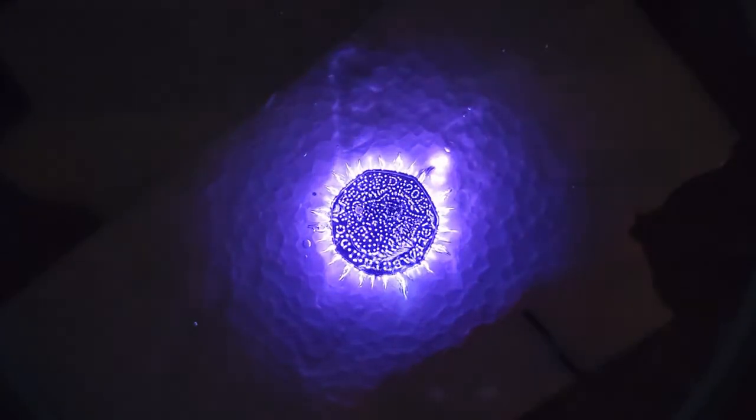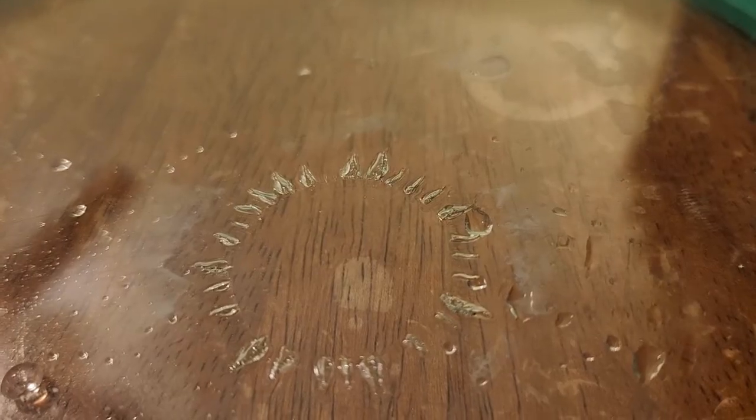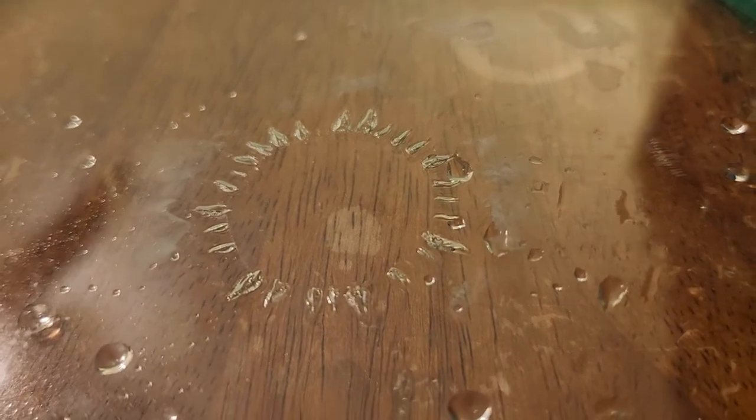I tried building a flat plate fixture with acrylic sheets, but that turned out to be a huge mistake. The heat melted a hole right through the acrylic and shorted the output and left a permanent mark in the material. So yeah, that's not gonna work. I'm gonna need real glass.